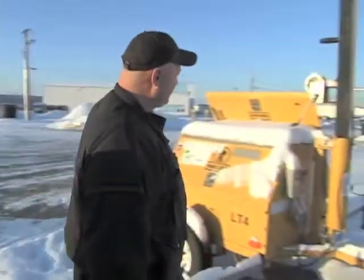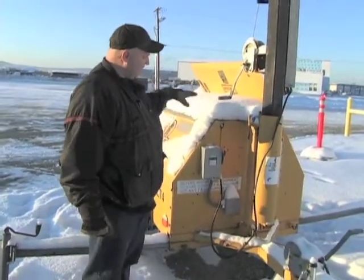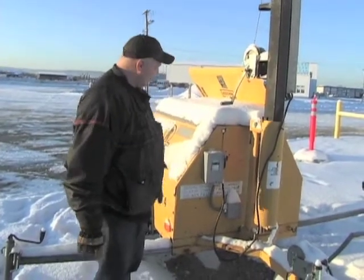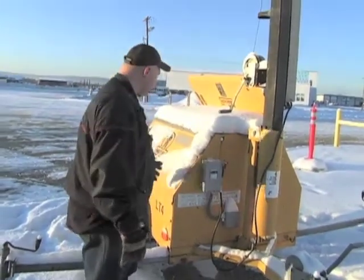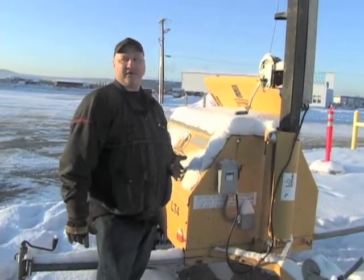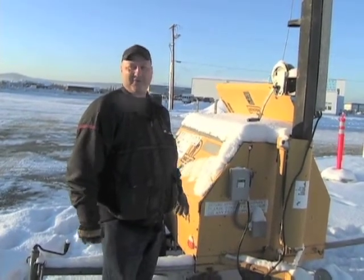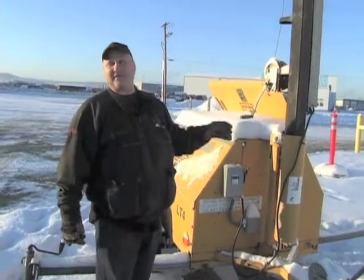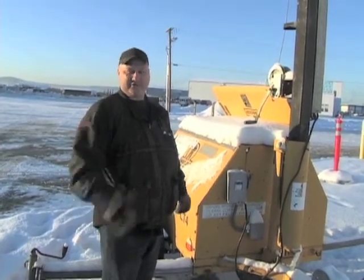We built in a kill switch here, so if we're working on anything inside, we can kill off the turbine power so it doesn't zap us. We also have connections for the inverter — it goes to the battery bank inside, which splits off to the inverter and the instrumentation, all powered by this cart. It's always on and always drawing a load. All the circuits are independent. We also have a high-amperage 100-amp kill fuse in case we over-speed or batteries touch each other — if we start drawing 100 amps, it'll just shut everything off.